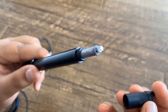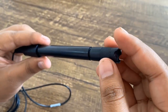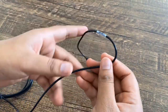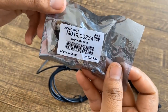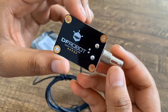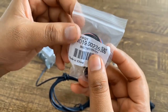Galvanic dissolved oxygen sensors consist of two electrodes — an anode and a cathode — both immersed in electrolytes. An oxygen-permeable membrane separates the anode and cathode from the measured water. This chemical reaction produces an electrical signal which is measured by Arduino. The cable length is 2 meters and has a BNC connector at the end. The signal converter board also has a BNC connector which can be directly connected to the galvanic probe. The signal converter board amplifies the minor voltage difference to a readable signal detectable by Arduino.